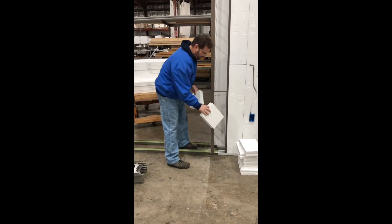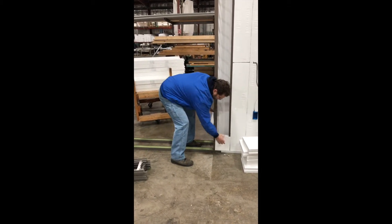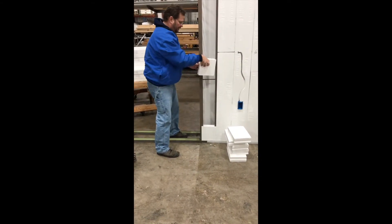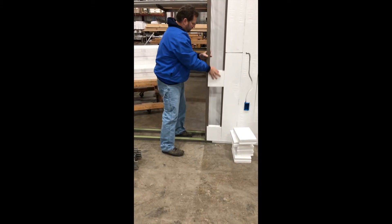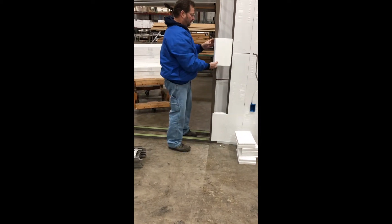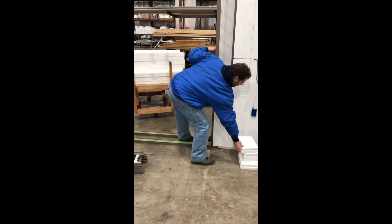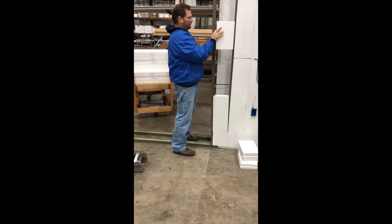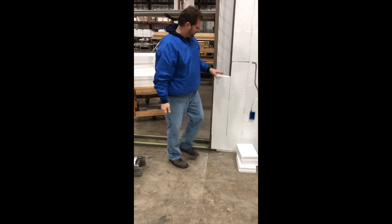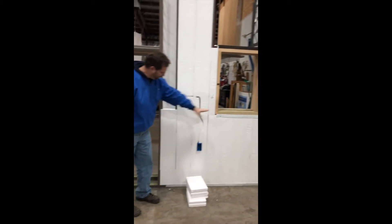A neat thing about the TF system is you can use up all your cut-off pieces, so there's very little waste. There's actually less than 1% waste if you use up all your pieces. You can stack short pieces however you want in the wall and fill up a whole column. These pieces come from cuts made below and above windows, and a good place to stack them would be in the area above or below the windows.